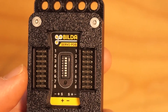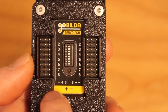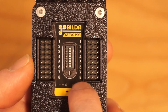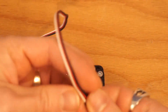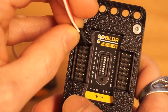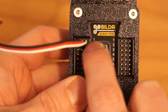I'm going to show you a couple of positional servo examples today. You can choose either side — I'm going to plug my servos into this side. You'll notice that the far pin is ground, then power, then signal. On the other side it's reversed: signal, power, and ground. Let's grab a positional servo and plug it in on pin number one. The number simply corresponds to the opposite side.